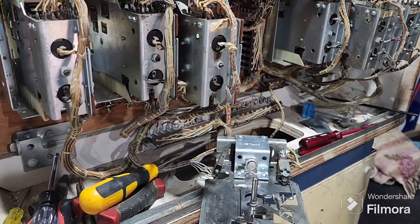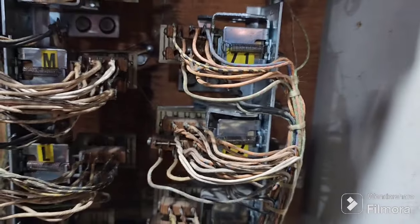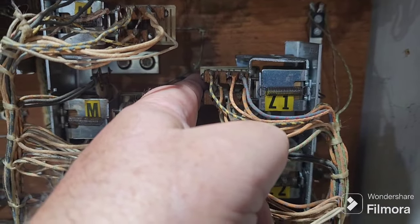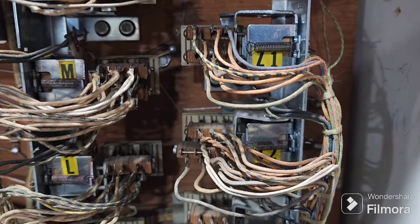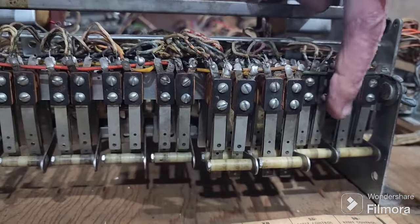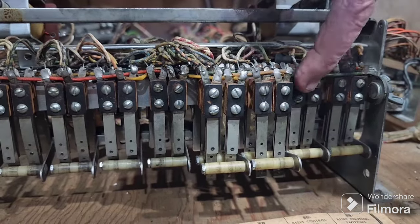Oh right, okay. These are the 3 relays in the back that were pulling in: the Z1, player 1 and 2, Z2, player 2 and 3, Z3, player 3 and 4. As soon as you powered the game on, they'd pull in, they wouldn't relax. The problem was a switch on the actual trip bank in the front of the game. I'll just show you that. It's on that one there, Kim, the reset. Here it is there, so Graham will point to the switch that was bad.